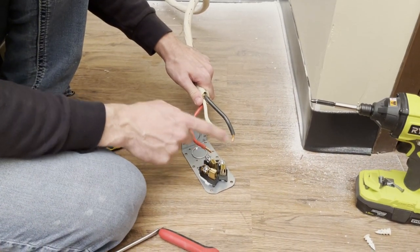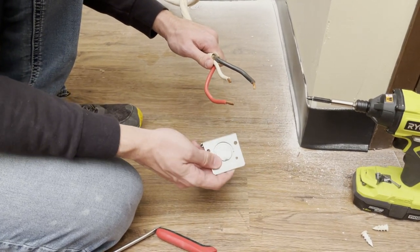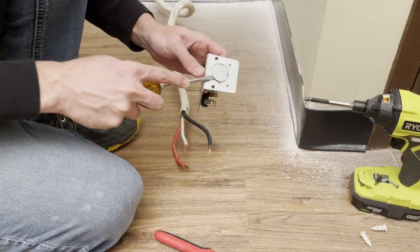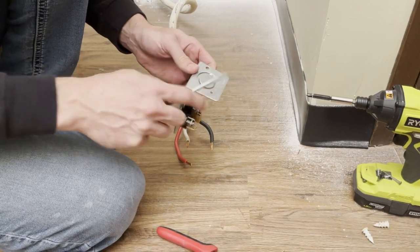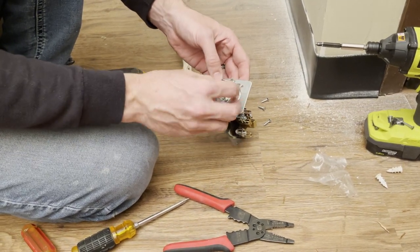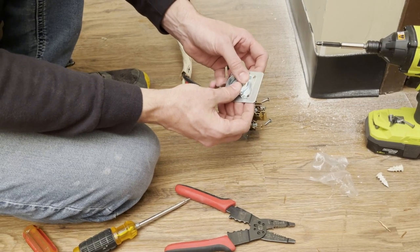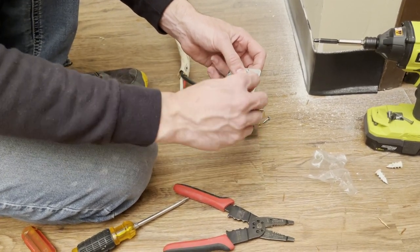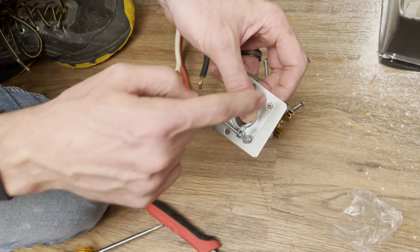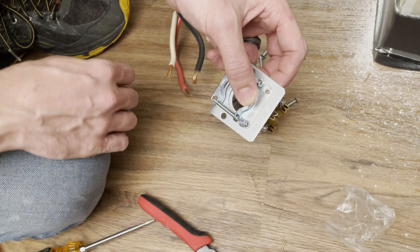Now that we've got this cut back and trimmed off to the correct length, it's actually going to have to go through the back of this housing. To remove that knockout, you can get it started with a screwdriver, stick it on there and twist it a little bit, and that'll pop off. Now that we've got everything ready to go, we've got to put this wire guard on there. On the back side there are a couple of holes — you'll line up the top two holes and use the set screws provided to put those in and tighten them down. The wire will then feed through the back, and then we'll clamp the wire down to keep it from pulling out.